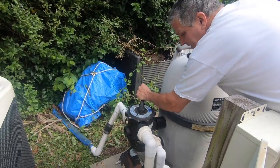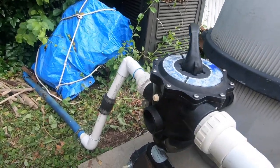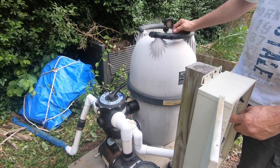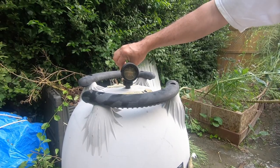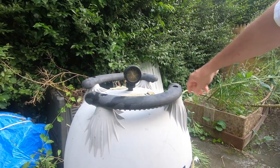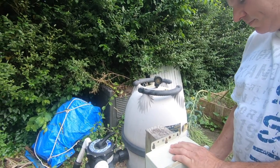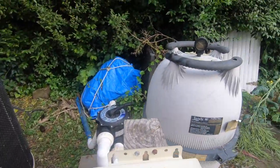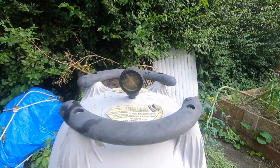The rinse might show a little more crud — actually looks fairly clear. Putting it on filter mode — might get a little air out since I opened that cork a lot. Pressure is at 23-24, better than it was at almost 30. You'll wait again until it gets back up to about 30 and redo it. If I turn off the Polaris, look where the gauge is — it's clean. The Polaris gives a little back pressure. With the Polaris on it's at 20.